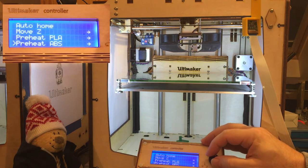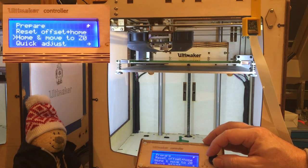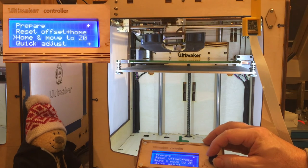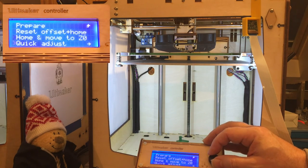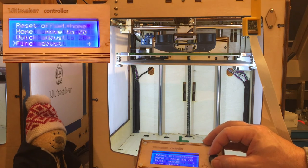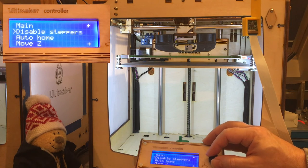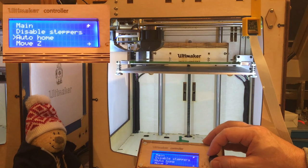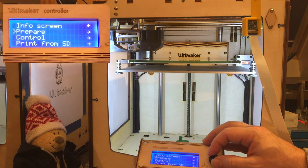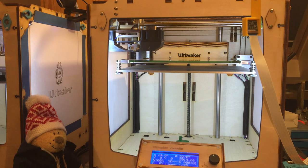Let's interrupt this print and show something else. If we go back to the Z adjustment menu now, we will see a second item: Home and Move to Z0. So instead of restarting from the beginning, it will just bring the bed to the Z0 position and allow you to fine-tune. Going directly into the fine adjustment menu, let's adjust by 0.200mm as an example. We then save, do an auto home, and you will see on the main screen that the Z offset has been adjusted. I hope you enjoyed this video about software bed leveling. Thank you for watching.